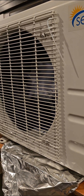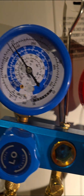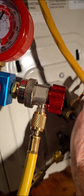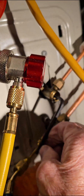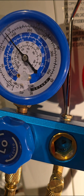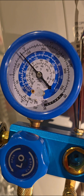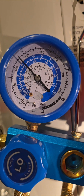As soon as the outdoor unit pulls on and turns on, the fan turns on — go ahead and do not, again, touch the one that has your hose hooked up. You're going to have about 150 pounds of pressure in it. You just want to close this one here down, turn it all the way down. And when you turn it all the way down like this, you can start seeing it's going to pump itself down, going down little by little, drawing the refrigerant into the outside unit.